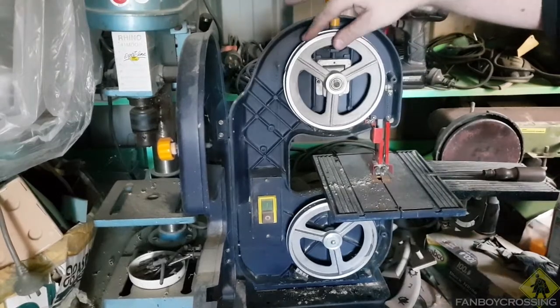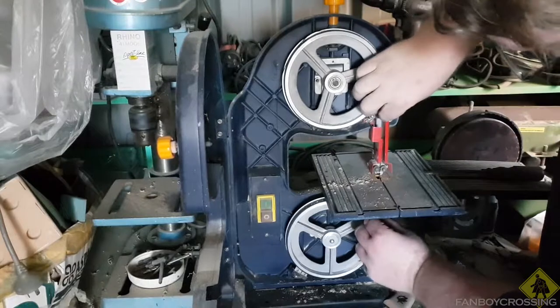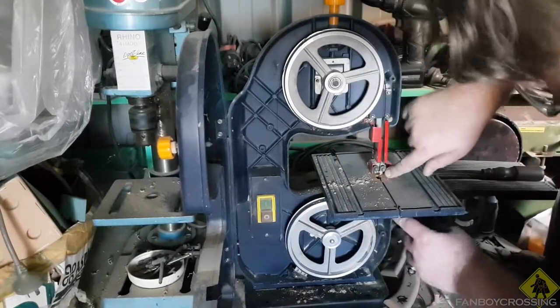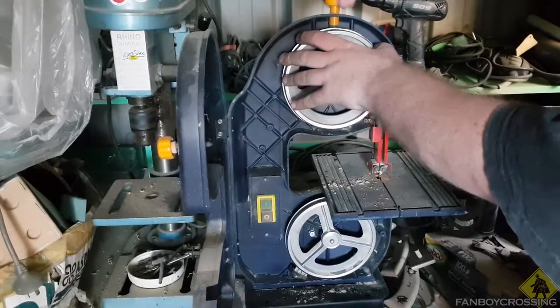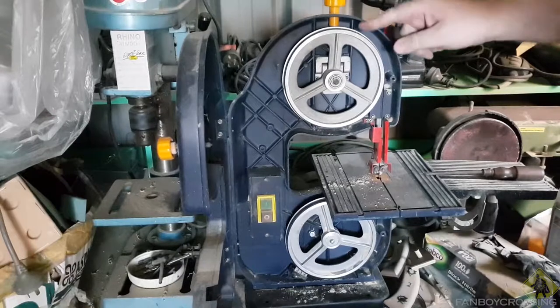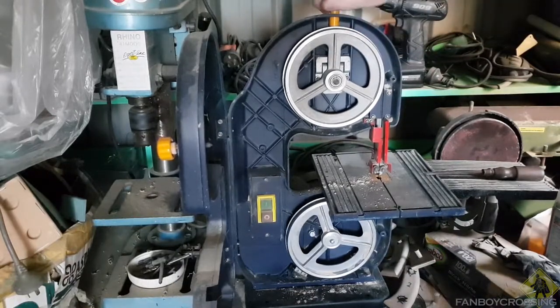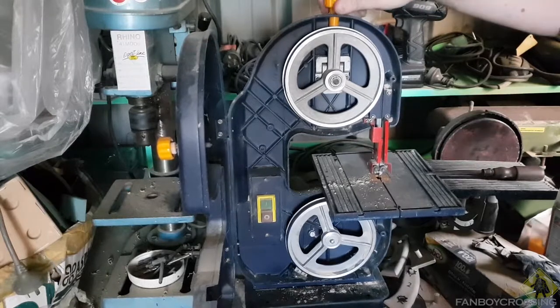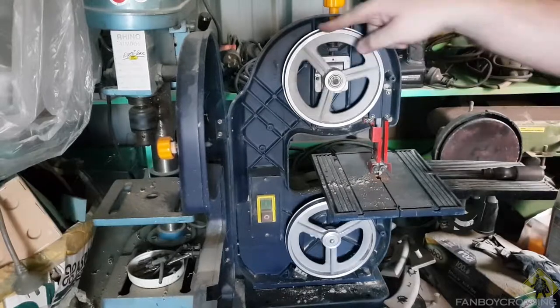So anyway, the belt's on now, it's feeding through all right. Make sure it's going through these two pin rollers. It's round that, it's moving, and then I can just start tightening it up. As you see, that's now moving. You should start seeing those kinks start going. You don't want it too tight. That's probably about it. You still want it to be able to move.